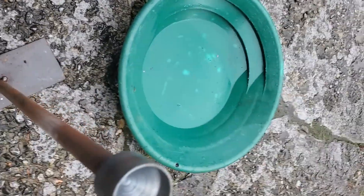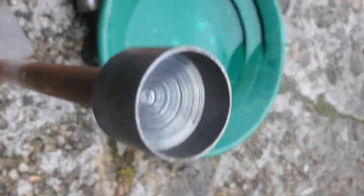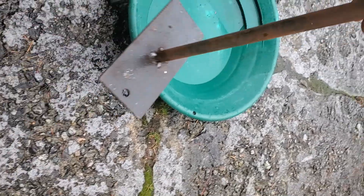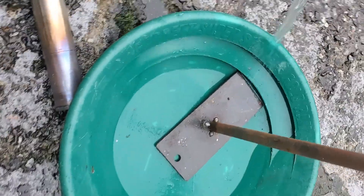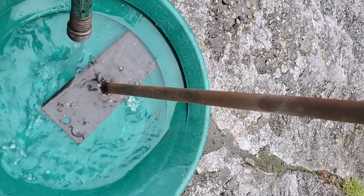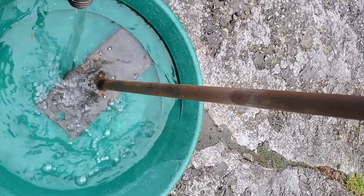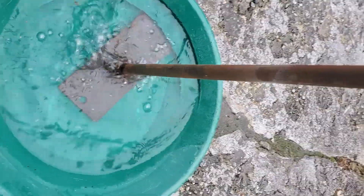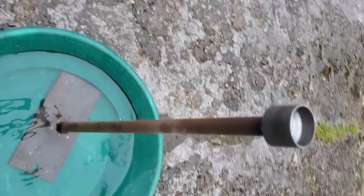So we're going to be retorting some gold today. You can see there's a couple of grooves in the bottom, a stainless steel tube, a little crucible on top — put it in our pan and fill it up. Mercury is our enemy when it comes to our lungs, so we want to make sure there are no mercury vapors going into the air. The old-timers figured out how to vaporize mercury from the gold.